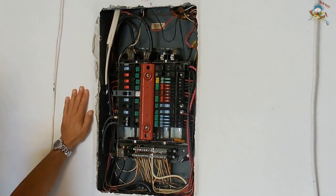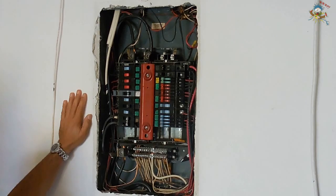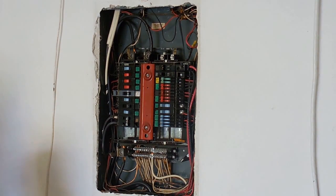This panel is a 100 amp panel. I'm going to be installing a 200 amp panel because in the future I intend on upgrading the service entrance, all the wires, and the main disconnect on the outside of the residence. So for today we're just going to be replacing this panel out. This panel measures around 14 inches wide. I was very lucky to find a General Electric panel that's the exact same dimensions, just a little longer, so I'm going to have to chip a little higher up here in order to install the new panel.